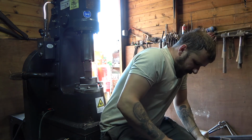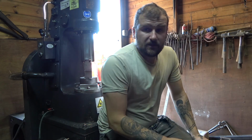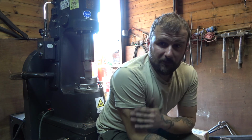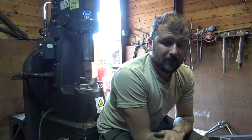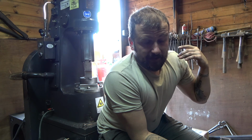I said the only problem I have with mine is the oiling system. Yeah, it does work, it's just the machining quality on the plunger to prime the system, because normally that plunger you'd pump it a couple of times until you get oil into the hammer and then start the hammer. But as I said, I just lift that lever and it'll pump round.